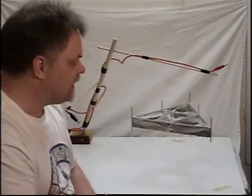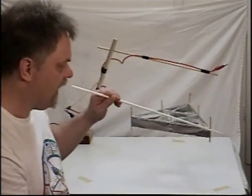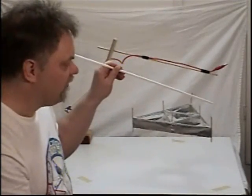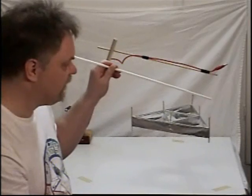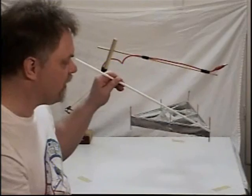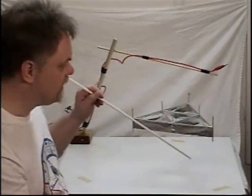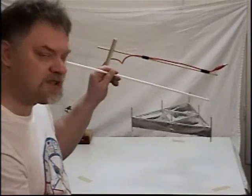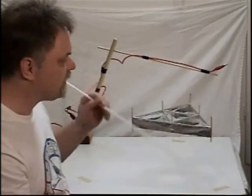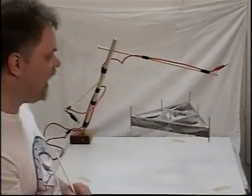The theory behind this is that you have the very fine wire above and the much larger skirt below. The wire above, being much smaller, has a far more densely packed field of ions or electrons than the comparatively much more diffused cloud around the tinfoil skirt. This asymmetry creates what was termed by Townsend Brown as an electrogravitic effect, essentially causing the lifter to fall toward the wire — or in this case, fall up to the wire.